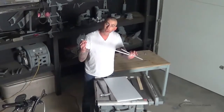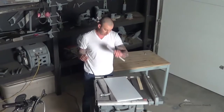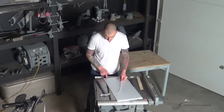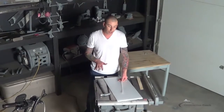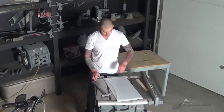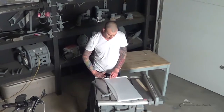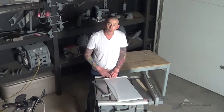I've got my long strip here, the exact blade's width of the dado that I cut into this piece along the bottom, and I've got another piece here for the vertical side. Where they cross, it doesn't really matter. Once I pound this in, I cut this corner off so you don't see this corner section, and it allows your square to pass when using it in the other direction. For now, I'm going to put the long side in using a hammer and a block just to tap it in. I'll use my miter saw to cut the corner off on a 45-degree angle, and then use my sander to sand a little section with a curve so my square can get past it.